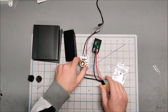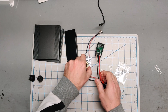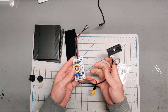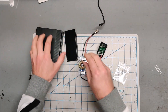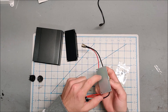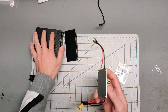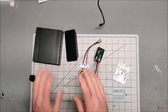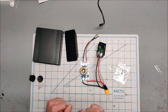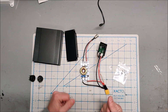I'm going to turn my little DIY solar charge controller into a real thing. This is the boost circuit I was using last week with the voltmeter and ammeter, and I'm actually going to put them in a proper aluminum case. I'm going to screw this down with heat sink compound on the underside, since this PCB was mounted on an aluminum heatsink — it can then sink heat into the aluminum case. I'll put a few switches to control the input and output, which is important so you can set different measurements. I'll assemble things, probably time-lapse that a bit, and then show you how it works.